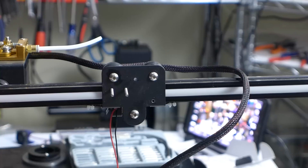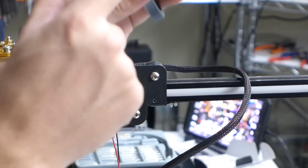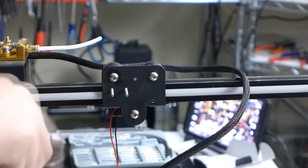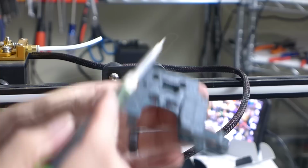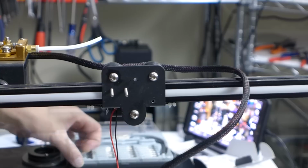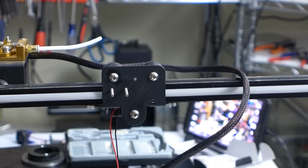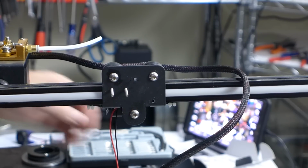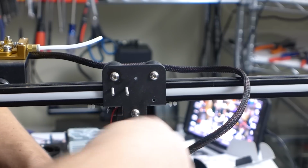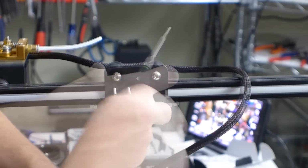So, that being said, here in the back we do need to go ahead and insert some M3s, which since I just took them off of this machine, I can go ahead and reuse them instead of using any of my own. M3 nuts, I should be more specific, so those just kind of sit right in there. And we're going to take off this big Bertha here. So we're going to take off the carriage. We're just going to take off the bottom wheel. That way we only have to move one wheel, so we can get to these other screws to get them off. Then again, maybe not.